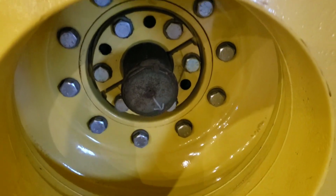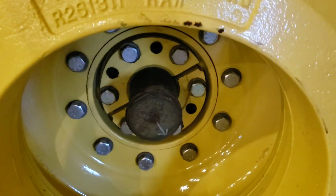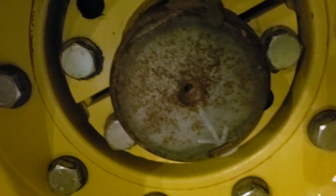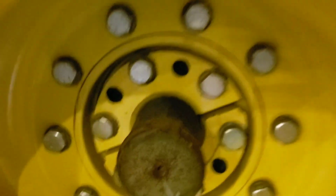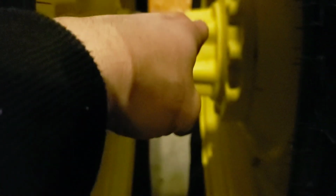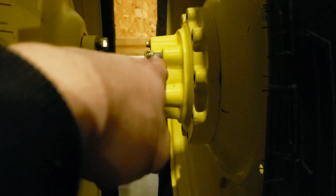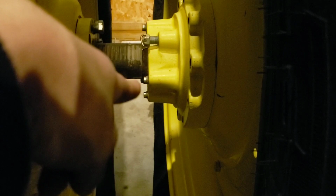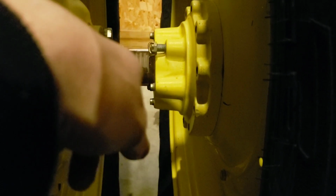This one here is a 7200R, and this is the new style hub, which does not have the bolts on the inside at all. They have external wedges, and you can see the little black caps there. You actually put bolts in there to push the wedges back out. And the same story goes. If you see that one there with the nut on it, that'll get backed out. That's the stop, the nut. You can see the others there, tip of my finger, how that has those special little ends. That's so you can use them as pushers.